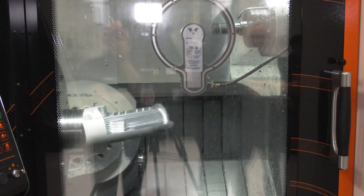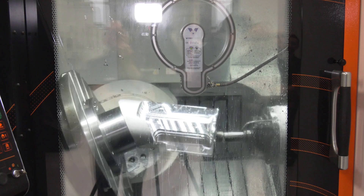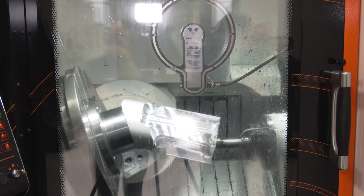Looking at it, we can see it's a horizontal five-axis. Is that unusual — most of your five-axis machines are in the vertical plane? We've developed a vertical five-axis range for a number of years, very successfully, but for a number of reasons we took the decision with this model to change to a horizontal spindle. The reason is that five-axis is now spreading into higher production requirements, so we've responded with a model that gives very fast, agile performance in five-axis machining.